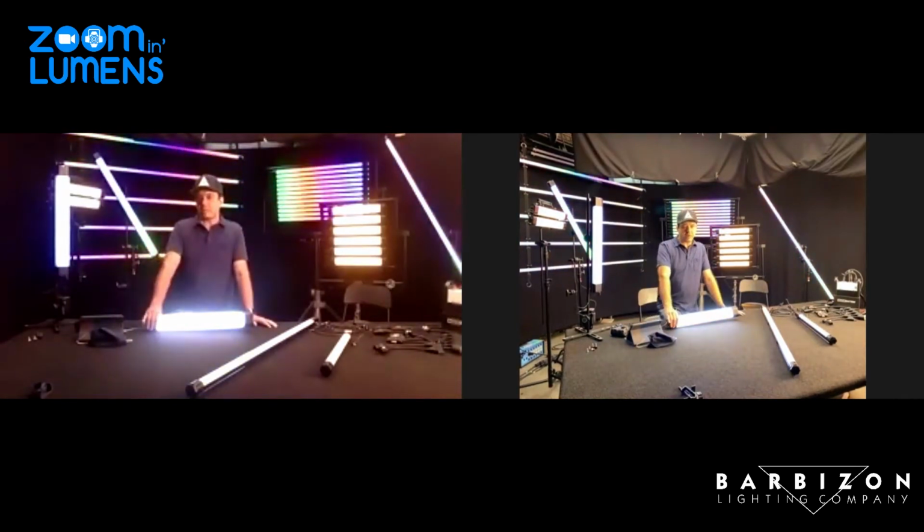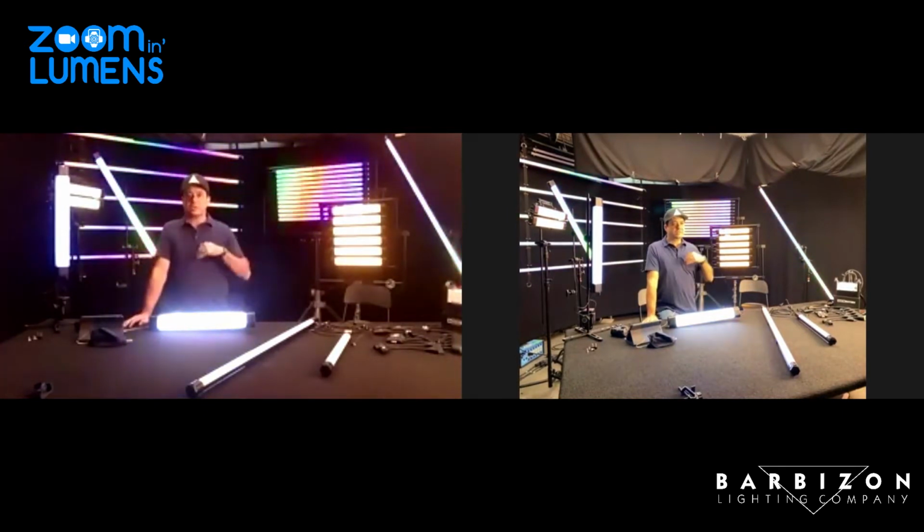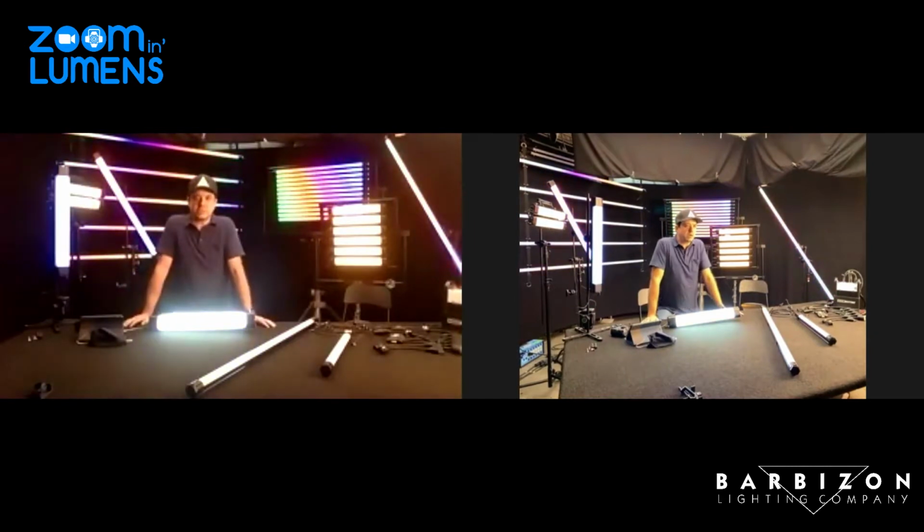Inside every double rainbow, there's actually a network switch inside that will allow you to pass through the Ethernet so that you can, in effect, daisy chain the lights when you're on Ethernet. Over DMX, you're only limited to the 512 channels when you daisy chain. So that's one big leap forward, the ability to do Ethernet-based control. So we have wired DMX, we have wired Ethernet, and we have SACN and ArtNet for that.